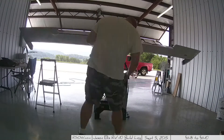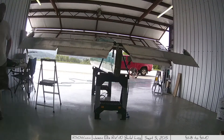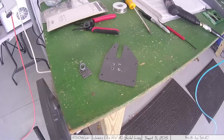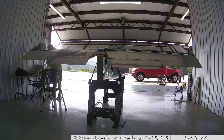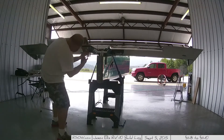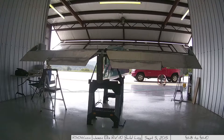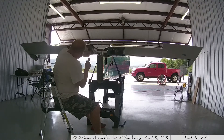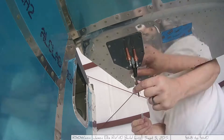Next I went to figure out how to install the elevator trim cable anchor sub-assembly — it's that little door with a bolt welded on it — and I realized there's no way to screw it on from the outside. I took those rivets out, which allowed me to screw that piece on with the bolt that's welded on it. I positioned it very carefully, clecoed it up in there, and I'll use pop rivets later to put those back on. That's exactly what Lynn did — he told me after the fact and I hadn't even realized it.